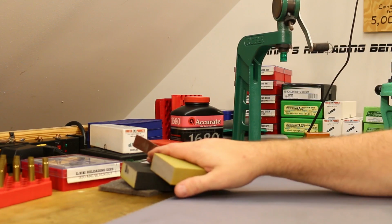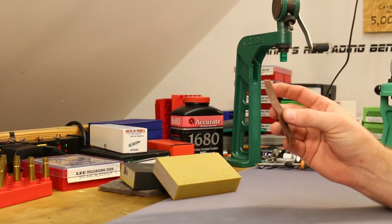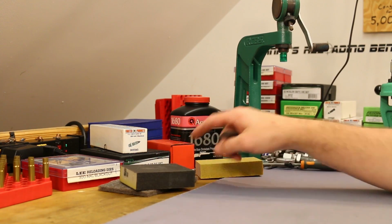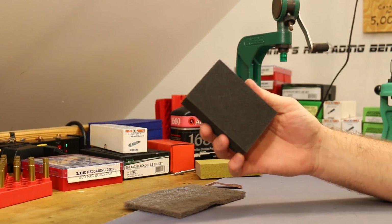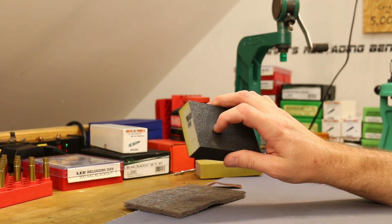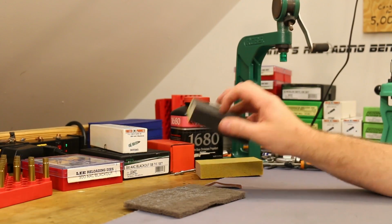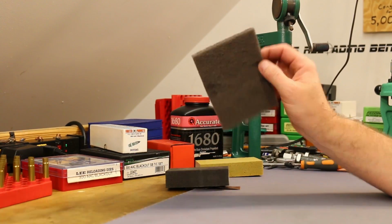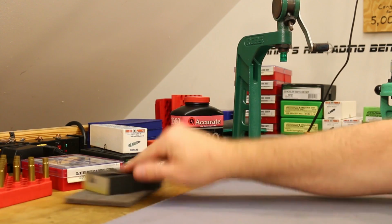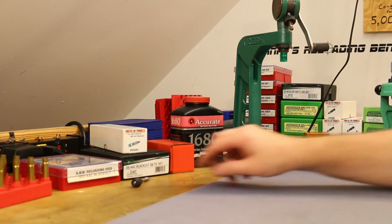All right, guys, it looked like we had the right sandpaper. This 120 grit really seemed to work halfway decent. But you definitely want something smoother to polish. This was a good combo. The 120 and then this sanding block. I don't know, it's a fine sanding block, and then some Scotch-Brite or some steel wool or something to finish up the polish was a pretty good setup for the job. So it ended up being pretty easy.